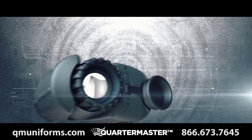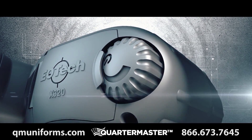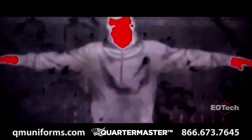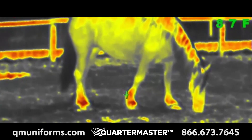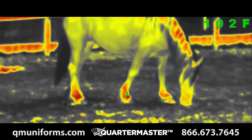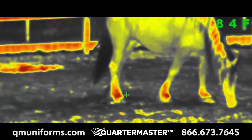The X320 offers a multitude of features through one easy-to-use push-button rotary switch. It features two, three, and four times zoom, white and black hot modes, as well as two programmable color modes and a custom color mode to precisely identify specific temperatures. The temperature mode also displays a centered crosshair to measure and display an object's temperature within a fraction of a degree.